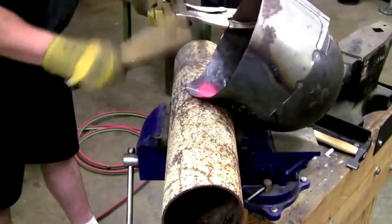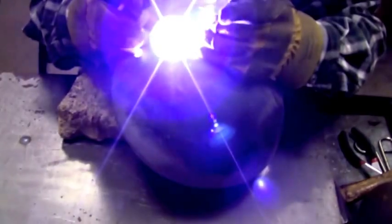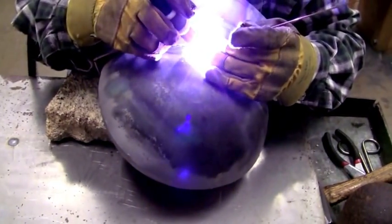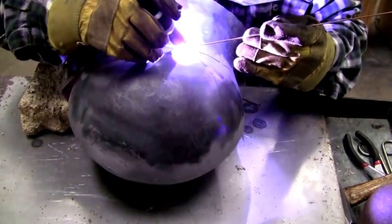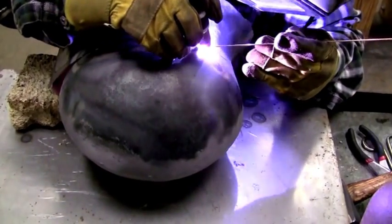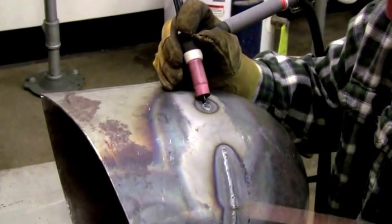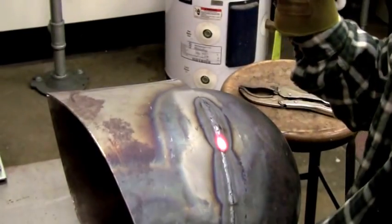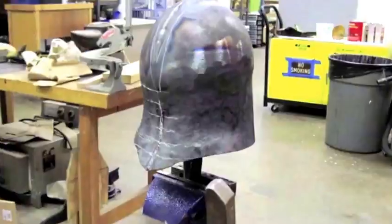Here I'm kicking out the tail a little bit more, and now that I've got everything in the shape I want, I apply the finished weld to the helmet. One thing you may notice is that the edge of the helmet where I'm welding has been sandblasted — that's because I really want to make sure I'm welding on clean steel. I don't want any dirt, grit, or slag getting into the weld; I want this to be a very strong weld. This is a neat little turn around showing you the flow of the entire piece.